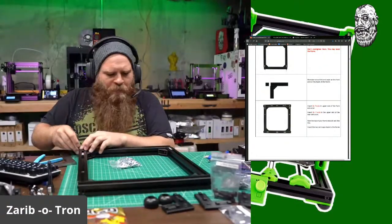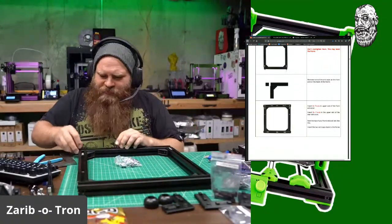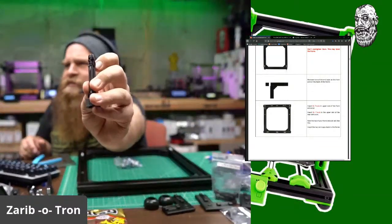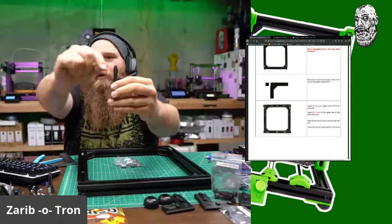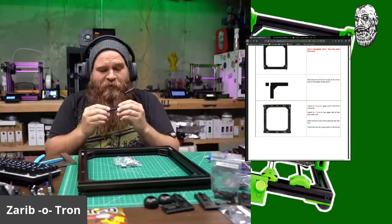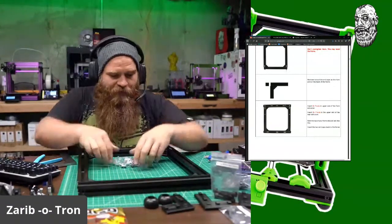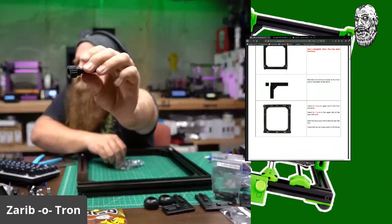I didn't change the minimum layer time. What I did was I added a second object. So when you print things like ABS and they're very small, because again, this is a very small object, there's no way it's going to print very easily. So I'm just printing two caps, so that when it's printing between the two, it'll take more time. Because the rest of the cap turned out perfect. Nice, strong ABS print. But at least the small one worked, so I can do the Y-axis.